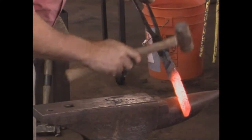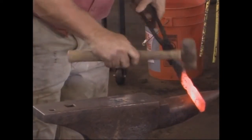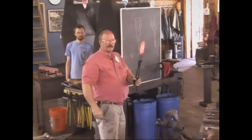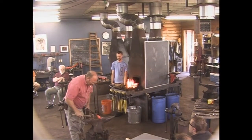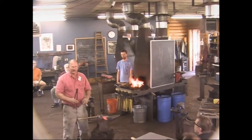That gives you just a little bit of a rounded ear — just a little concave — and I think that just adds a little bit more grace to the axe. It's kind of hard to see, and I'll admit that I'm going to clean that up on the grinder anyway. We could spend all day filing it. I am more of a fan of filing all the time, but not for something this big.